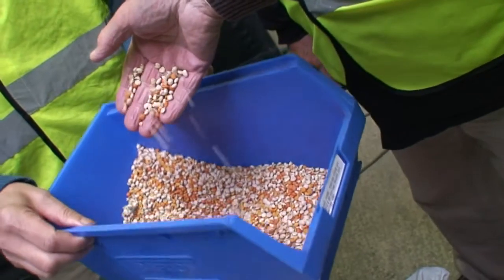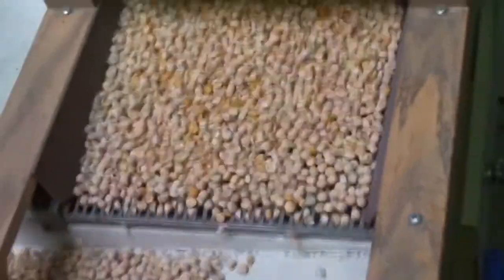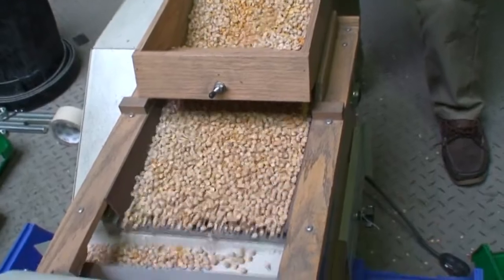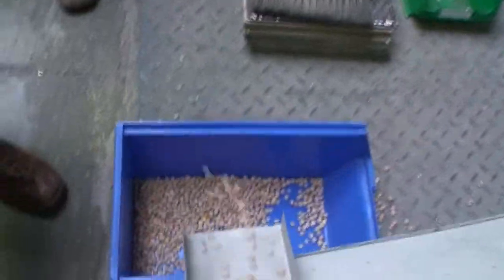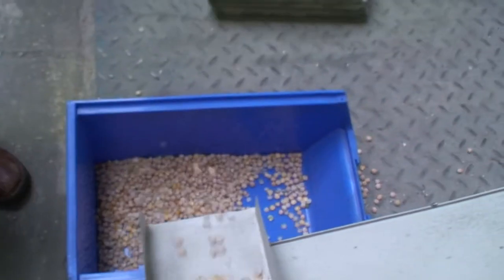The speed of the huller is also a critical variable. Go too fast and you smash the seed to pieces; too slow and you're not de-hulling efficiently. Whatever speed you settle on, you won't achieve 100% de-hulling, which is why a cleaning process is essential afterwards. The important thing is to do experimental work — test what speed and cleaning you need, get the right screens, then you can ensure an efficient process.